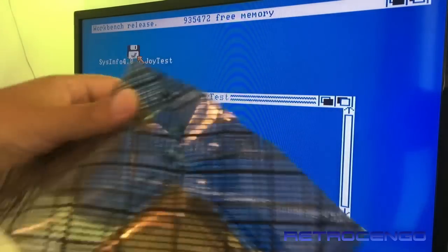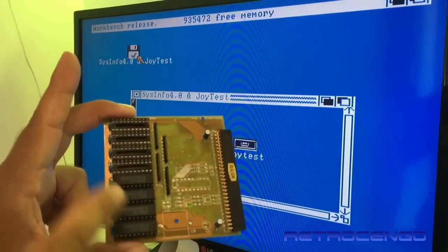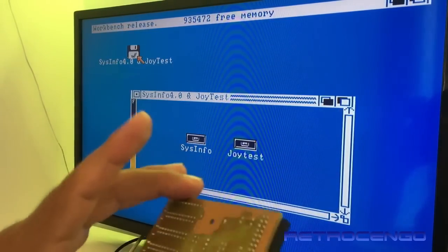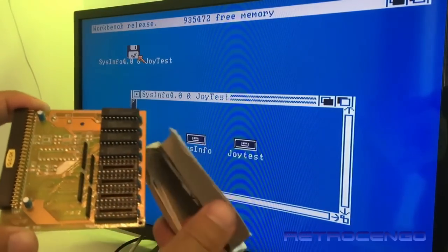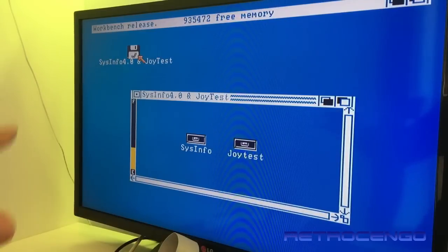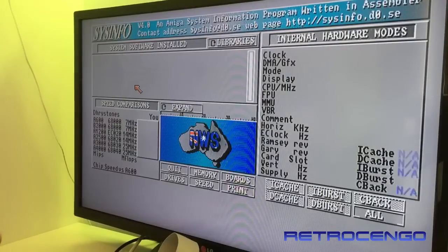Let's look at this card over here. Now I'm sure it will show as 512, because if you want 1 megabyte, I think these over here have to be populated also. And it also said it has some jumpers to choose between them. The battery over here is nice. As you saw, it's brand new in box with a thick manual. That's nice. But this is probably only a 512 kilobyte RAM expansion. But the one that I have installed is 1 megabyte, and it shows as 1 megabyte in an Amiga 500 Plus motherboard. So that means Commodore made this board just like the normal Amiga 500 boards. And it's okay, because it was sold as an Amiga 500.